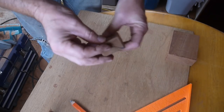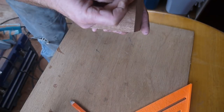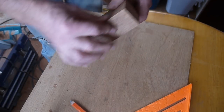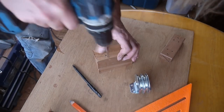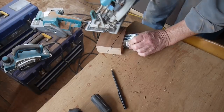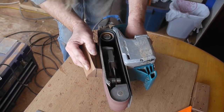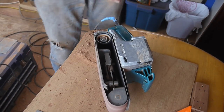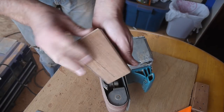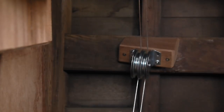Because this block is going to require such a severe trim - in fact it's going to come through the face - I've opted to make another block, which is the same dimensions. But now when I carve it, I will have enough material left so that it won't come to nothing. I'm just going to make this block up, transfer the scribe to it, and see how it fits. And prettied up with the chamfers - let's see how well that fits. That is absolutely it. I'm really, really pleased - it lined up perfectly with the top of the stringer.